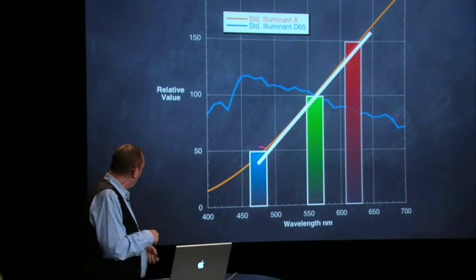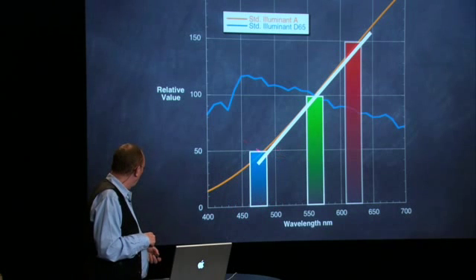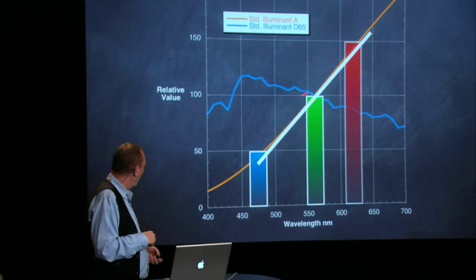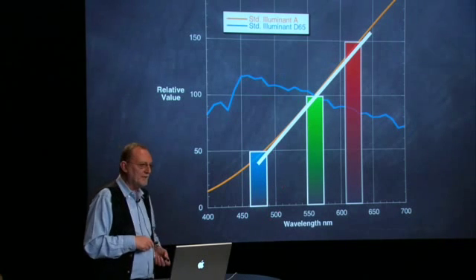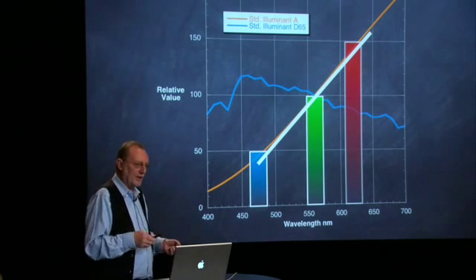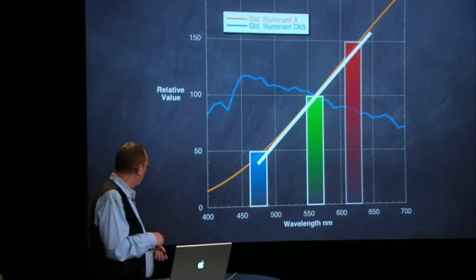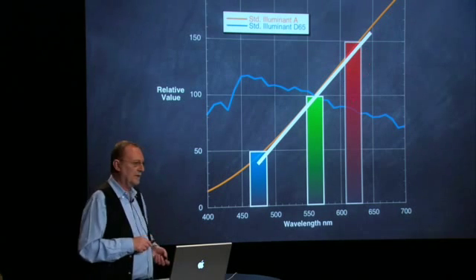What you see is that you have very little blue light. So in order to color balance this camera back to equal, we need to boost that blue signal — in fact, we need to double it. There's about 6 dB of gain on the blue channel, and in any CCD or CMOS camera, if it's balanced for tungsten, there's 6 dB more gain in the blue channel. And of course we've got a surfeit of red and infrared, so we need to reduce the gain in the red signal.